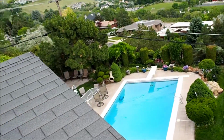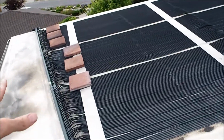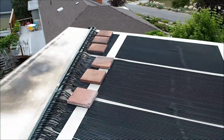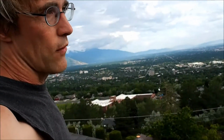So the pool pump pumps the water from the pool to the pool shed down there, where it goes through a filter, and then up to these solar pipes, which are basically fairly inexpensive black plastic tubing, and just winds its way back down the other pipe and absorbs and transfers energy from the sun to the pipes to the water. Most solar pipe systems simply run for a fixed number of hours a day, and on cloudy days like today or rainy days, you may be losing heat rather than gaining it. Hence the two temperature sensors. We measure what's going out versus what's coming back, and we can tell if we're gaining or losing energy.